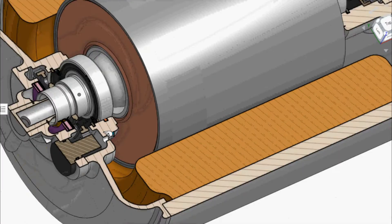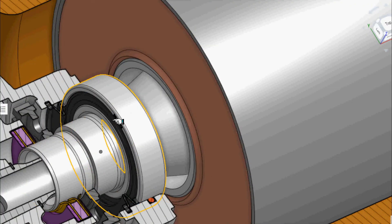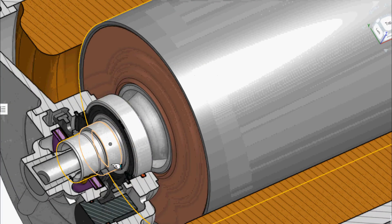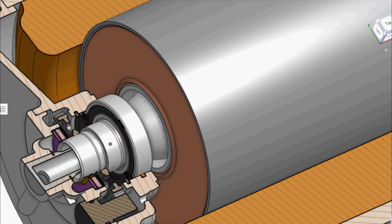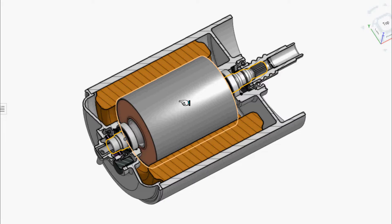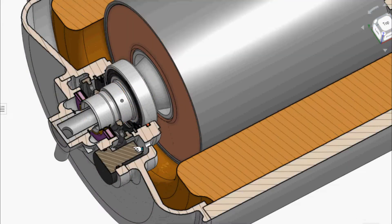When shutting the hole, these differences are equalized instead by air flowing through the bearing seals. This may draw grease out of the bearing, especially at higher temperatures when the grease viscosity is low. This could shorten the life of this bearing. Theoretically, it's also possible that the entire rotor moves quickly, including both bearings. This could require a relatively large hole to quickly equalize pressure differences.